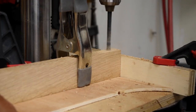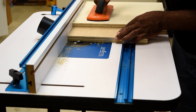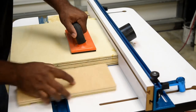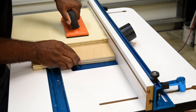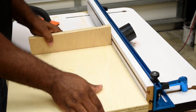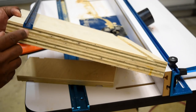The threaded rod needs to pass through one bar and into the next. Now I'm gonna route in two three-quarter inch slots into the base, one on each side, and this will be for the inserted T-track. Placing a piece of wood in the front and back of your routing path will greatly reduce any blowouts. Repeat the same steps for the opposite side and just remove enough material for the T-track to sit flush with the surface.